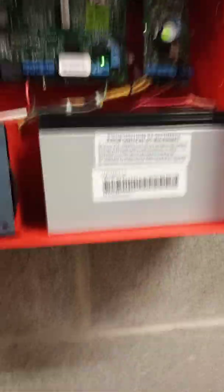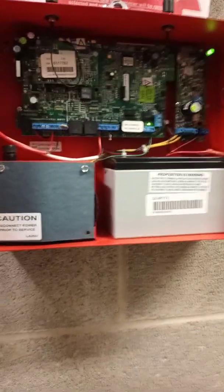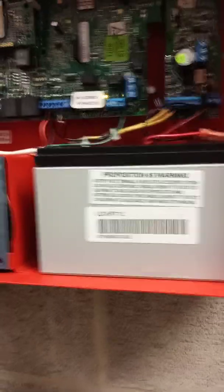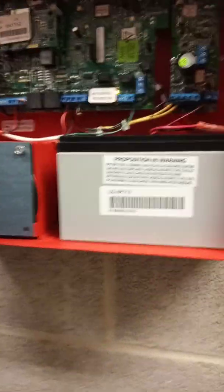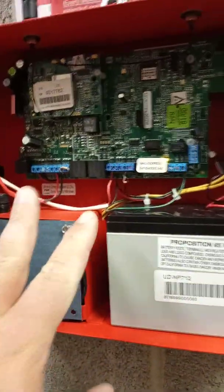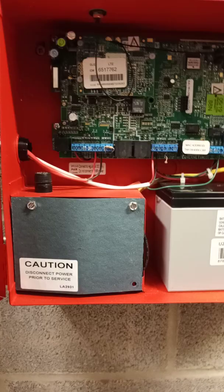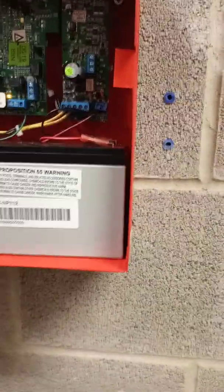This right here is aux power going up over here to our communicator. So this is communicating just alarm and troubles, and I'm going to call over here in just a little bit to verify that they did get a trouble and not an alarm. You need to do that because I've seen people accidentally reverse them in programming where they flip-flop alarm and trouble. If I call monitoring, they should get two troubles and no alarms.